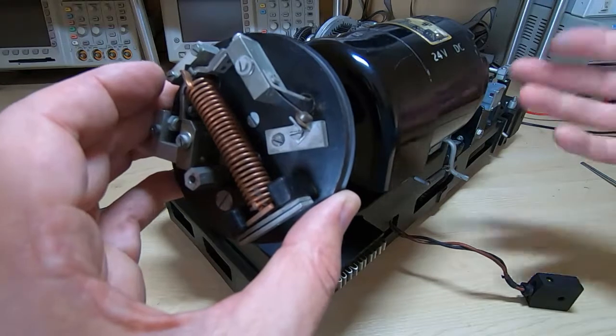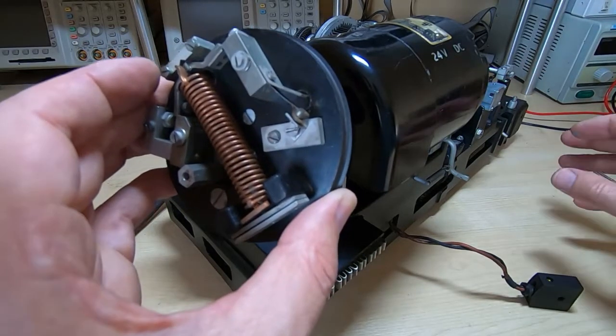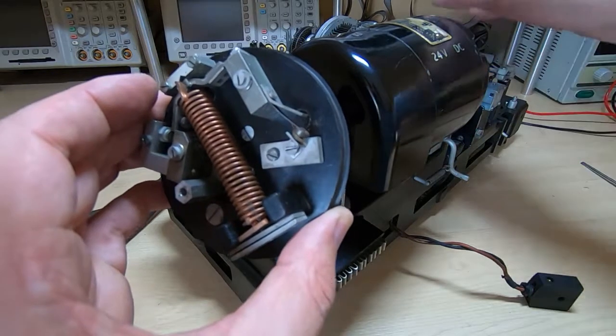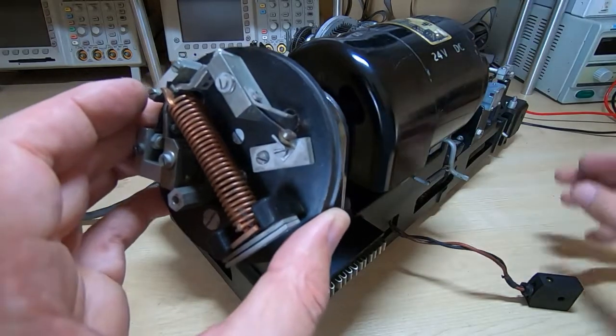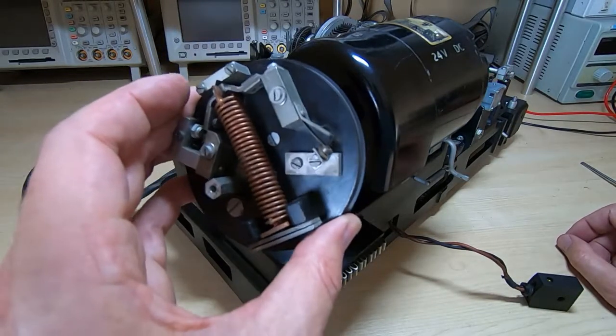So, in other words, you might be running at an arbitrary baud rate, and because that baud rate will be the same for the keyboard as it is for the receiver, it will appear to work. But when you attach it to something else that's running at the correct speed, obviously it's not going to work.